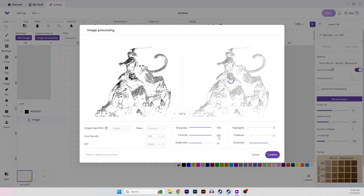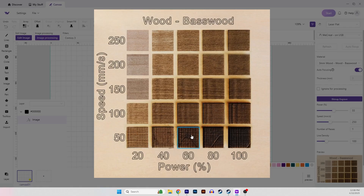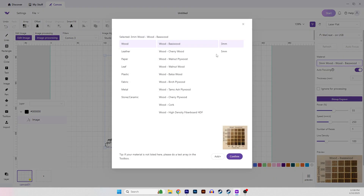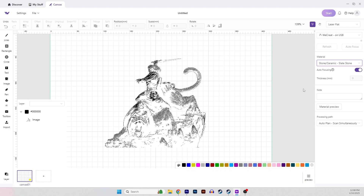Second, and this is only a symptom of the software and the system right now, is that I don't think the presets within the Make It software are calibrated or set up correctly for the 45W Vision Pro. I think it's miscalibrated. I think the powers for the different feeds and speeds are too high — I'd lower those quite a bit to get good results out of the machine. But that's something you'll learn with time and every machine is going to be a little bit different. If they're going to have those presets built in, they should be calibrated better for the current machine, especially for people using it for the first time. They're going to get some results that are way off.